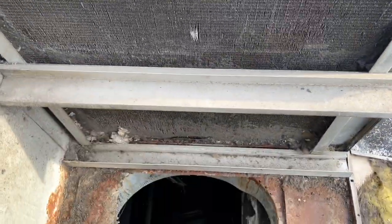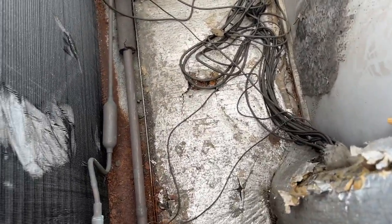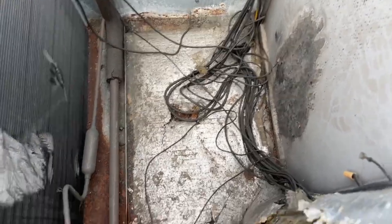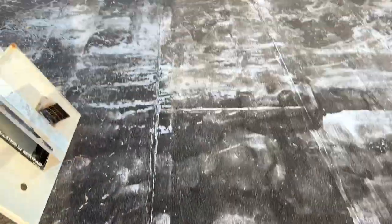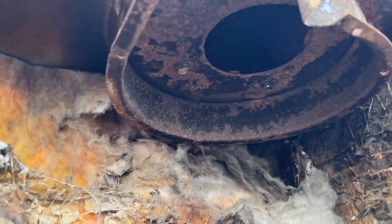It's completely disintegrating, and the loops on the other side look like that too. Here's our evaporator coil, which is just dirty. And here's our blower wheel and blower motor, which is really easily serviceable. Another easy access point is our inducer motor, right here.